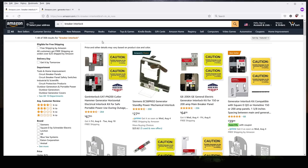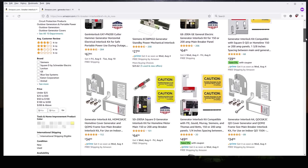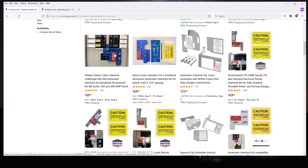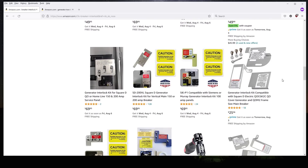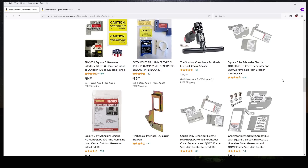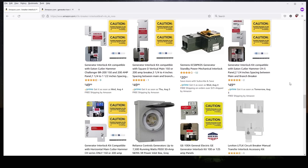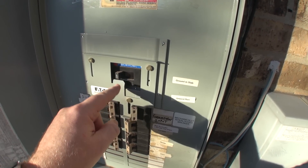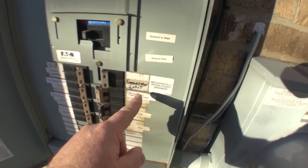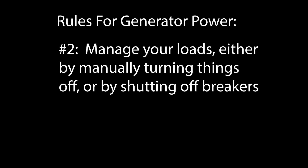The other method is called an interlock — it's what I used. An interlock is a slightly fancy metal plate thing. The idea is that you attach a metal plate designed specifically for your breaker box that will physically block your breakers from a combination that would allow your main power and the breaker coming from your generator feed to be on at the same time. They make different versions for different breaker boxes, and you'll need to find one that fits yours. Basically, it's just a flat piece of metal that's vastly overpriced at around $70, but it absolutely simplifies safely and legally connecting up your generator — now you just have to install a new breaker dedicated to your generator feed with four wires, versus a big transfer switch that's completely rewiring your entire setup. If the inlet breaker is on and the generator is hooked up, then your main power is off — they physically can't be on at the same time because the plate blocks the position of the breakers.